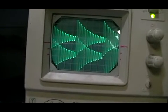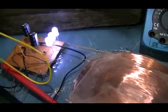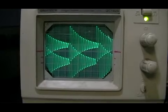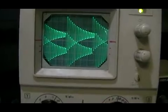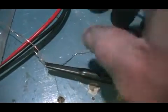The other interesting thing is the pulses on this — we go high and then low, approximately 50/50 percent on the duty cycle. Whereas this is saying that both pulses are in phase with each other, which is quite interesting. It's simply the probe on one end of the coil and the ground on the other.